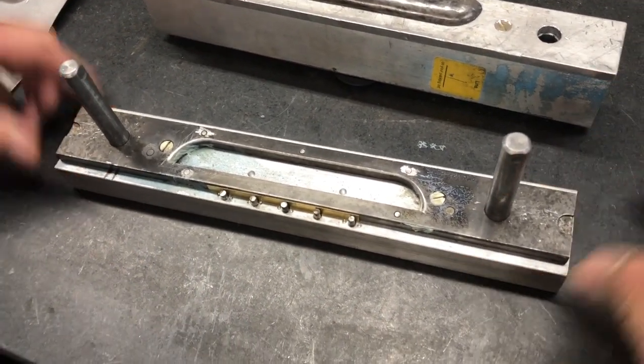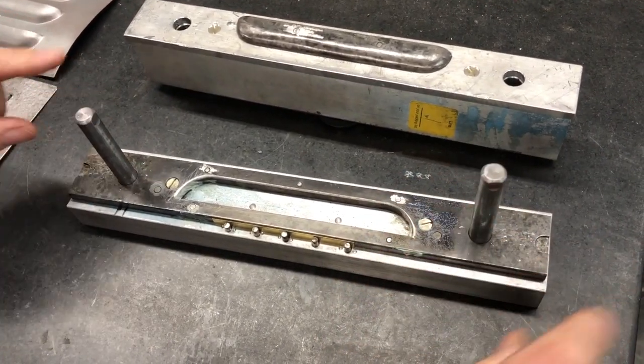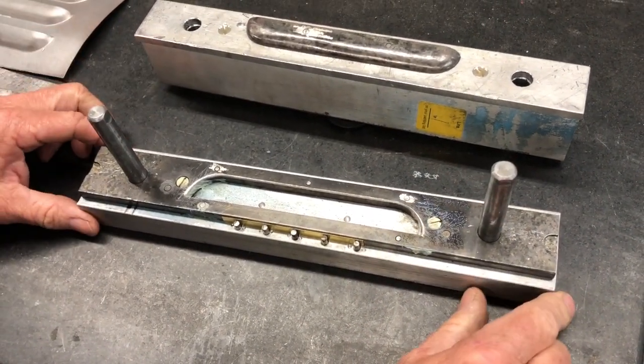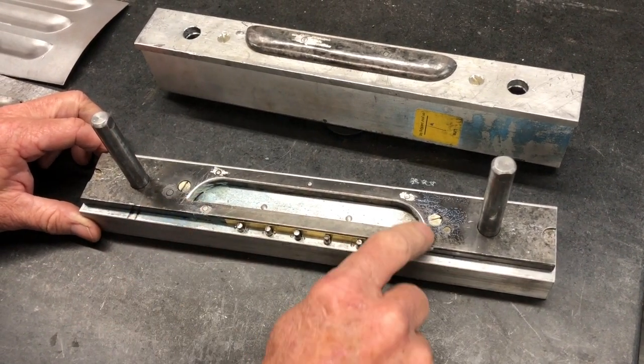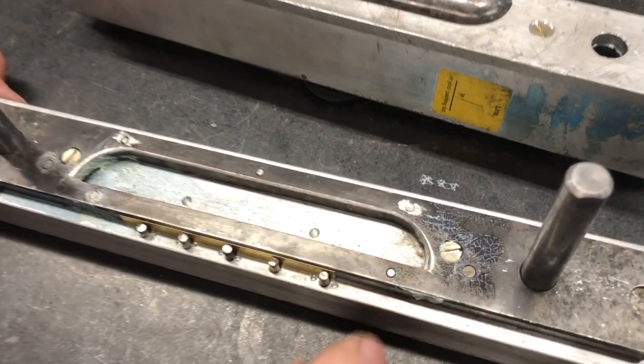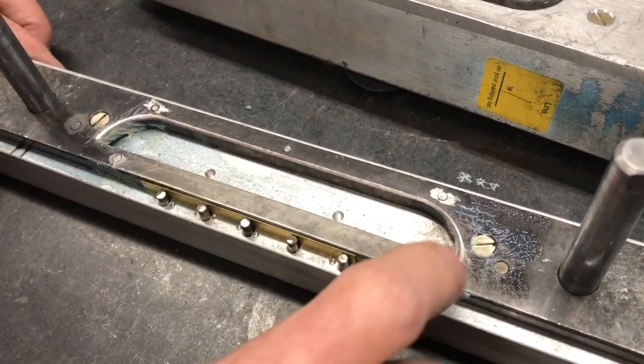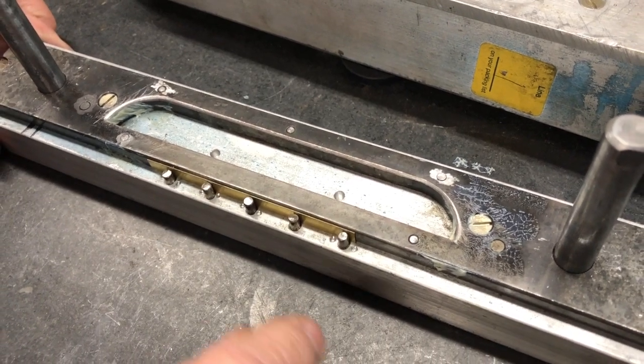It's an aluminum base. These pins are just half-inch bolts with the heads cut off to act as guide pins, and I cut out the profile in here. I broke these edges — it was kind of a learning curve. It was shearing right in the corner, so I've also put grease on when I punch them. That seems to help.